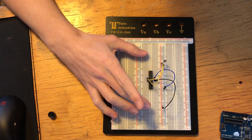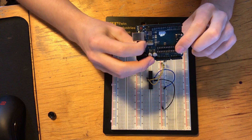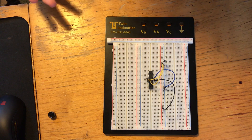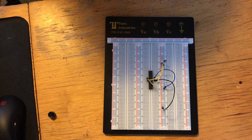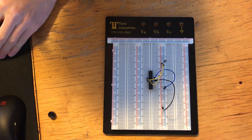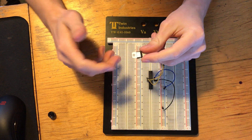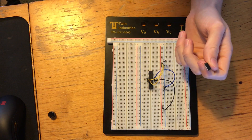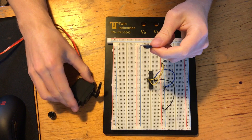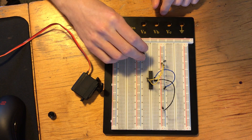What you have to remember is that these chips don't run on a very large voltage. On a normal Arduino you have a crystal that makes sure it runs at 16 megahertz. However, with this one I'm going to be running it on the internal oscillator at eight megahertz, so I don't need a crystal. I'll be running it at much lower voltages, so to ensure those low voltages — especially when running on battery — I'm going to be using a voltage regulator. Because we're using a servo, this setup is only going to be running at 3.3 volts for the chip, whereas the servo is going to be using something like seven and a half volts. The regulator will take that seven and a half and convert it down to the lower voltage needed for the chip.